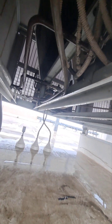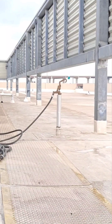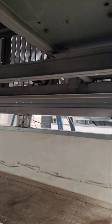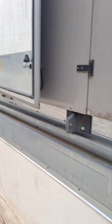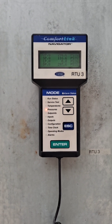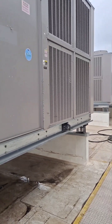Just because the way they look doesn't mean that's the way they are. So I took some water — look at that, water on a roof — and I cleaned off the condenser coils with water. Then I manually used the navigator to turn on the fans, and I went old school and was slapping the coil to get as much water off as possible.